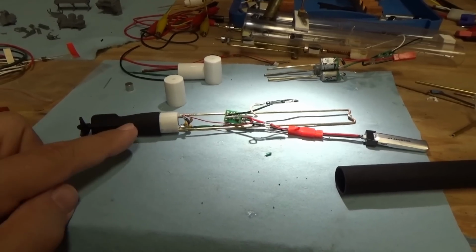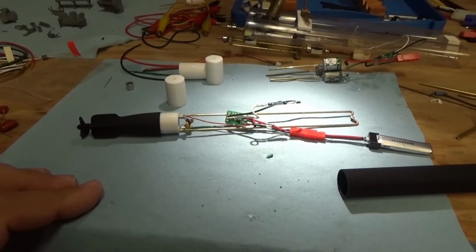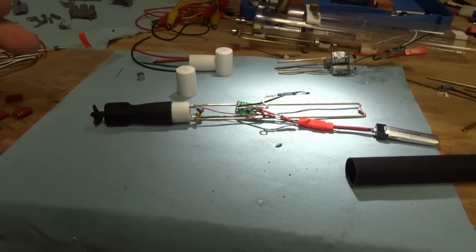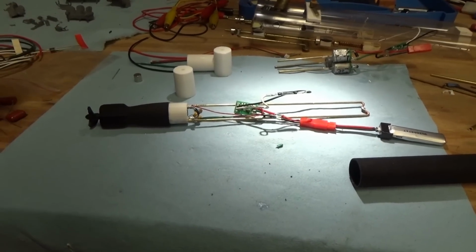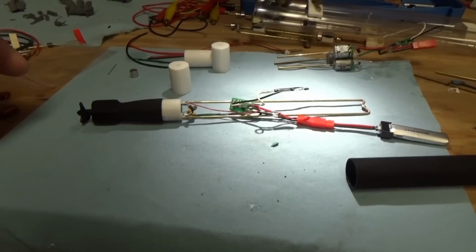So certainly the torpedoes will be less than, probably 8 inches of depth. And there's not going to be a lot of water pressure at that depth. So that was the idea. And really that had to happen that way because the motors are not torquey at all. And traditional seals will bind up and really affect the RPMs and the current draw, so I went away with that.